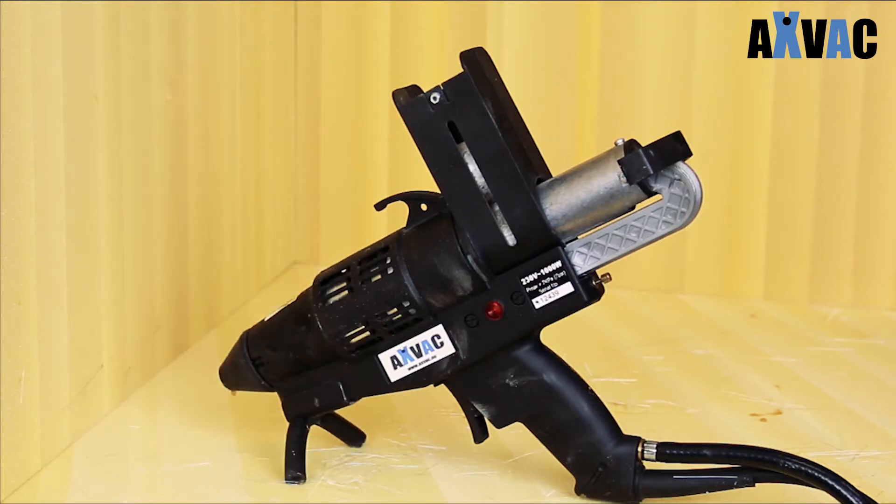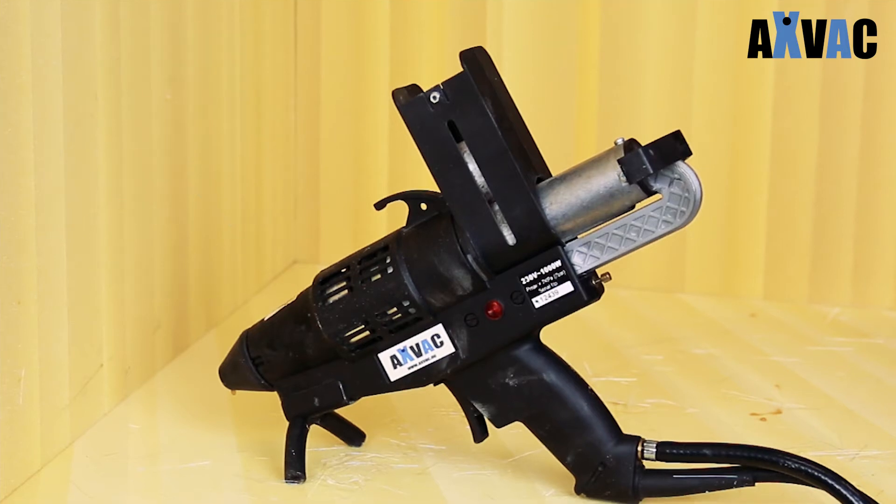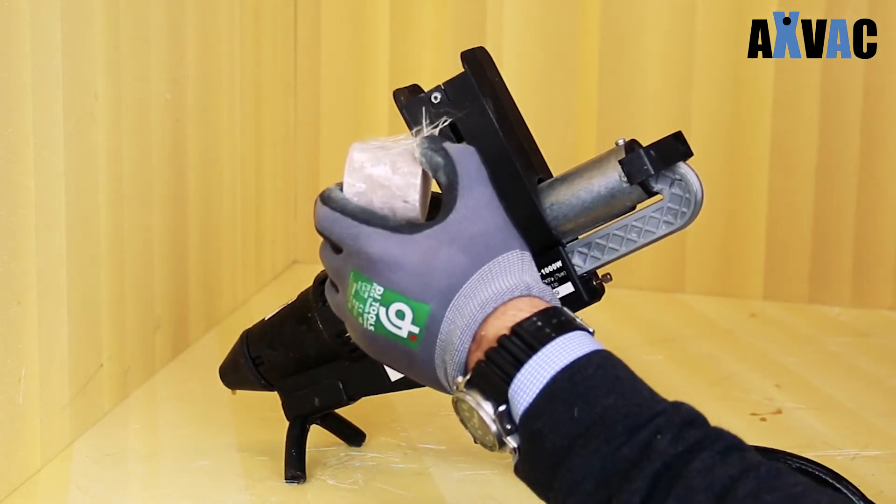When the air and power have been switched on, please wait 5 minutes so the 2x500 watt heaters on the TEC 7300 spray gun are heated up. Then load the hot melt glue slugs into the speed loader.